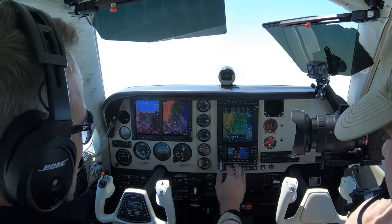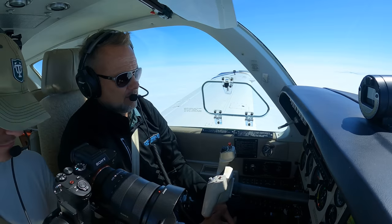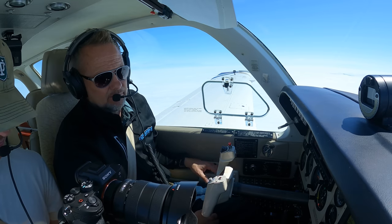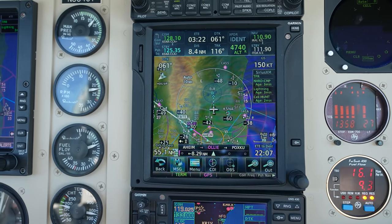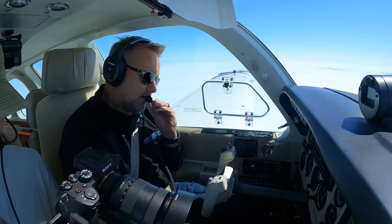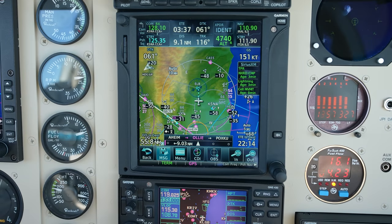This autopilot is doing well. It's an old autopilot, but it's holding altitude really good, holding heading really well, and obviously a real workload reduction. This may have been done before they certified the GFC 500 autopilot — I don't know why they didn't put that autopilot in, but I think that's an upgrade available for them. In a nutshell, these older autopilots can be integrated with the G500 and GTN 750; it's just going to be a little more complex when it comes to button pushing.